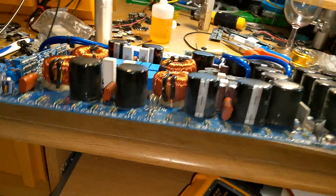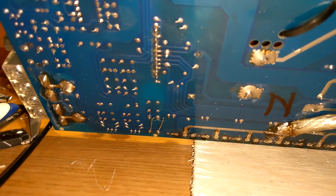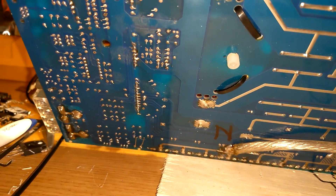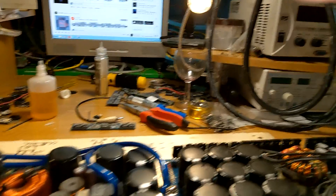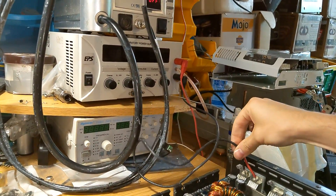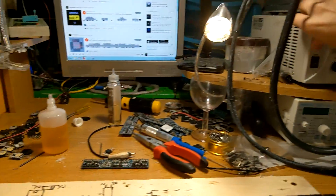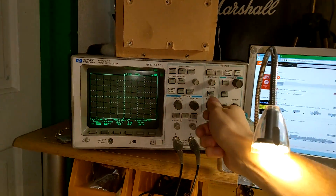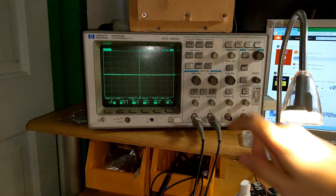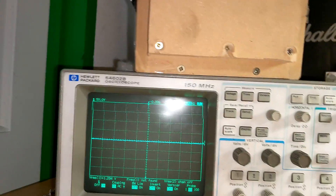On the bottom of the amplifier you can see I've already done this to confirm it fixes the issue — the small wires are there. I'm going to solder those on now and show you the difference on the scope. That's just very roughly soldered on there for the video. Let's bring the amplifier back down, plug the power wire back in. Let's start the scope up again, turn trace memory off so we can see what's going on, and probe the low side gate again. Now let's fire it up and see what we see on the scope.